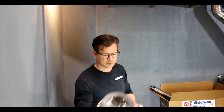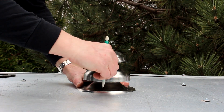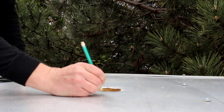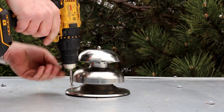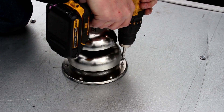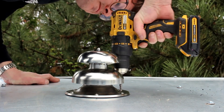We start with the chimney cap and gasket. These require a minimum 3 inch hole to pass through the roof. If needed, mark and drill pilot holes for the mounting screws, but do so without drilling through the rubber gasket to prevent leaks. Complete the cap install by tightening down each screw to compress the gasket underneath.